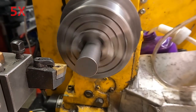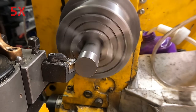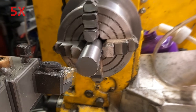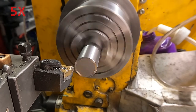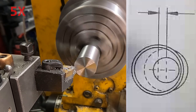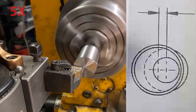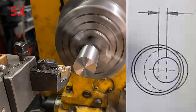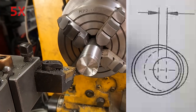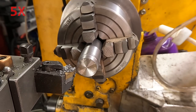The kit came with a piece of 3/4 inch steel for making this next part. I didn't get those materials from the kit, so I'm actually using a piece of 7/8 here. The part has two diameters which are offset from one another, and if I used 3/4 stock like they would have supplied, both of those centers would have been off center from the stock. So I had a piece of 7/8 which is already cut to length, and that way I can do one of them on center and then just one of the other will be off center.